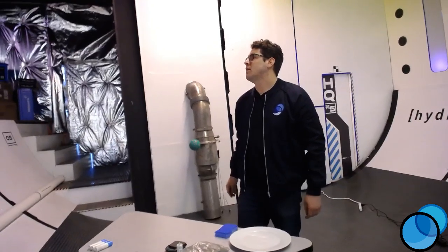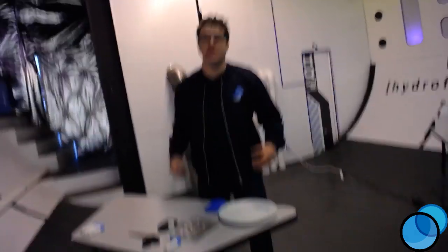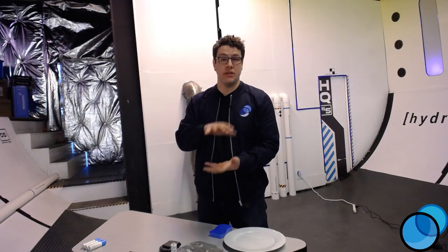What was the other question? Can you leave water in it? Yeah, you can leave water in it. We don't recommend that if you're going to leave it sitting over the summer or over more than a month or two. I would recommend emptying it out and leaving the fuel cell or the electrolyzer inside of it dry.